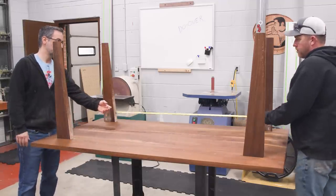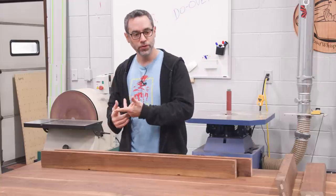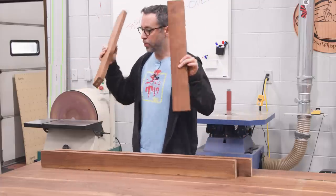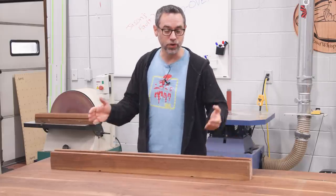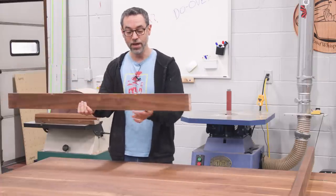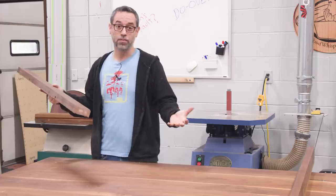So let's go for the short rail measurement now — that looks like a straight-up 26. This is looking pretty good so far. We're going to reuse the legs, we're reusing the top of course, and now we have a couple of rails to cut. These short rails I don't think are going to be good for anything here — they're too short, and if anything everything is getting a little bigger with the base. So these will go into the pile in the back and be used for something else later on. The two long rails are not going to be good for the long rails of the new base, but they might be useful for the short rails, which need to be cut down anyway. We have plenty of material to make that cut. We'll pick whatever we think is the best portion of the grain and be able to reuse these. We're also going to use this as a model for the width and thickness because we will have to get some new material just to make a couple of long rails — but that's not bad considering we're reusing most of it.